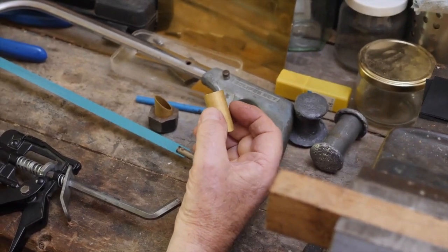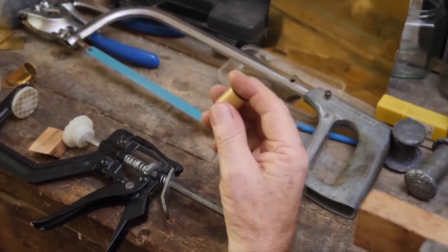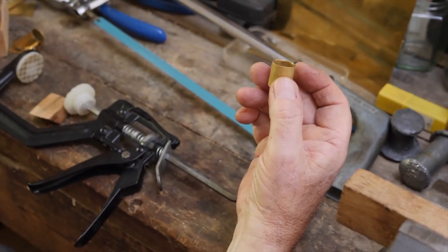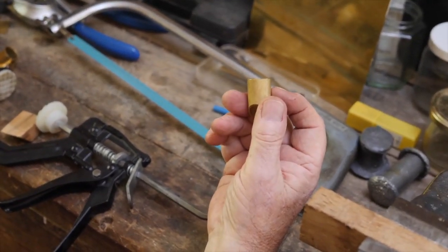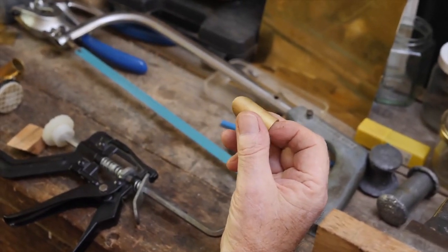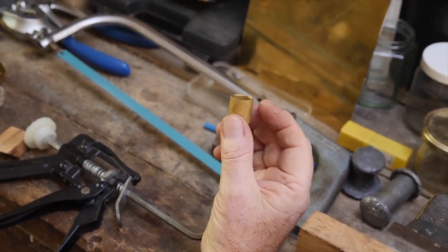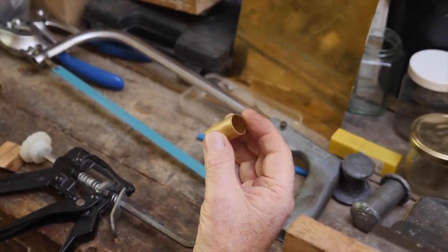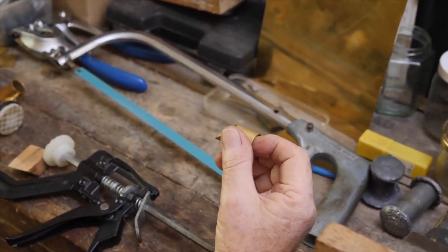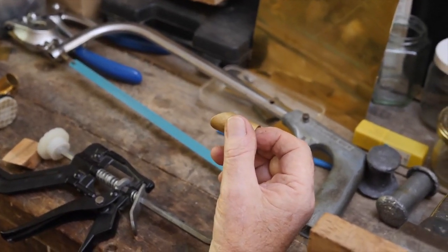Cold water would do, but it is not ideal because it always leaves a very tenacious film on the surface. But if I use dilute hydrochloric acid, it comes out nice and clean. Where do you get your dilute hydrochloric acid from? It's a drain cleaner that you get from the hardware store. Okay. And it's very good for silver soldering as well. Is there a particular brand or is it just drain cleaner? I don't know, I'll have to show you the bottle. It's different brands, I know.